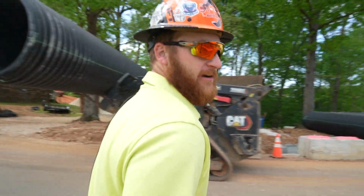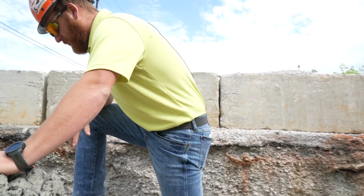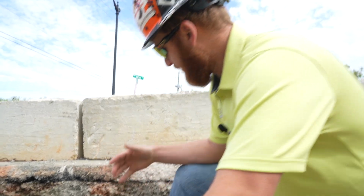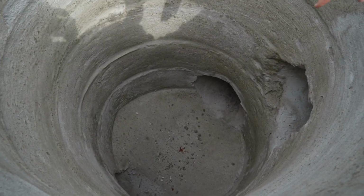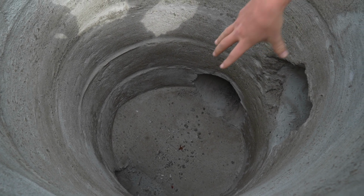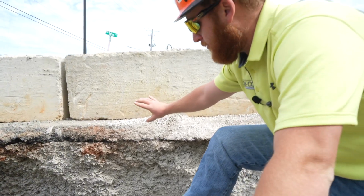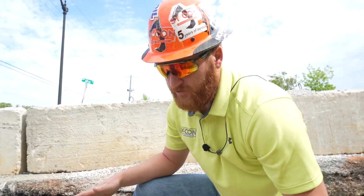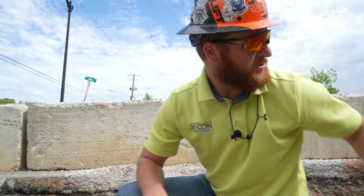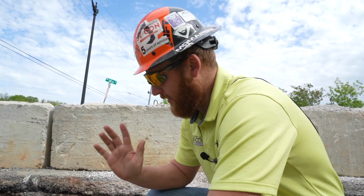All right, let's go take a gander down here. All right. Oh my Lord, what we got going on here? So a dropper inverts into this. We're catching this pipe coming this way. Everything's flowing that way. This pipe drop inverts into this box and runs out. Like I was telling you guys, this will also be a curb inlet box. So that's why the structure is formed, just like the one I was showing you guys up there the other day. This one wasn't formed yet.